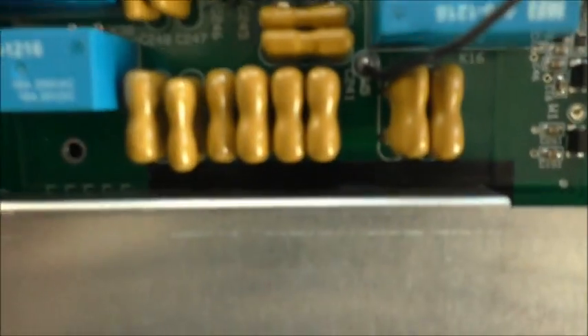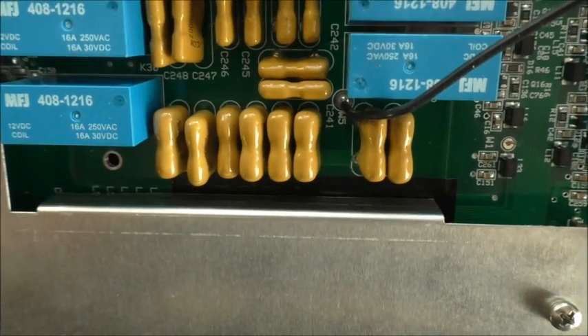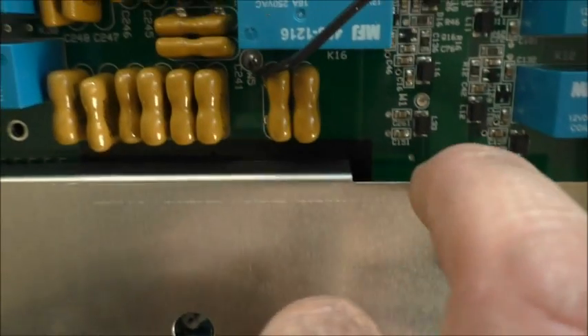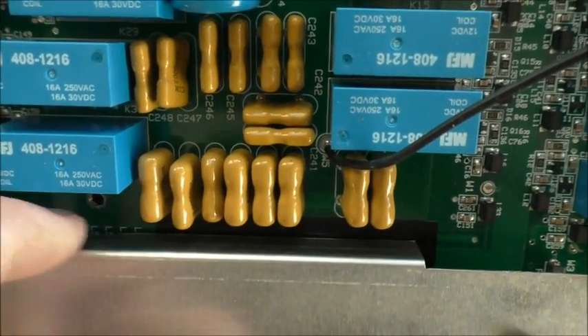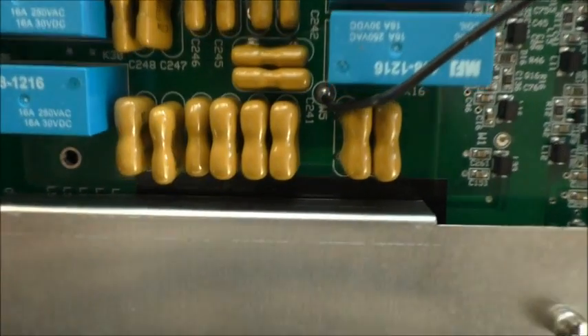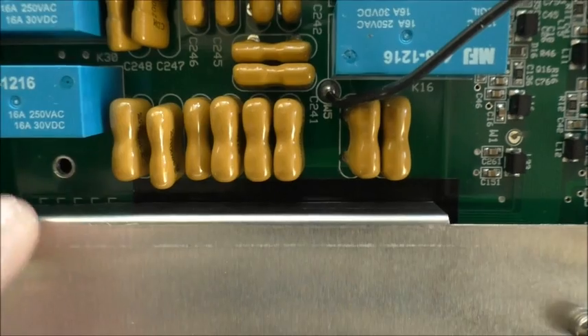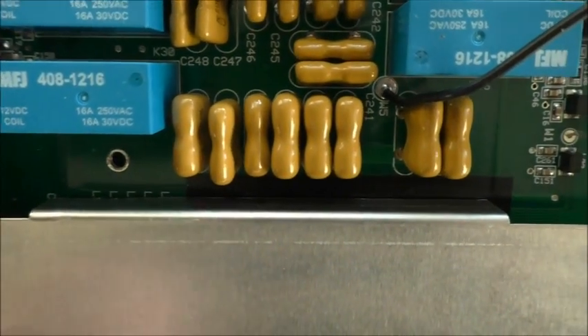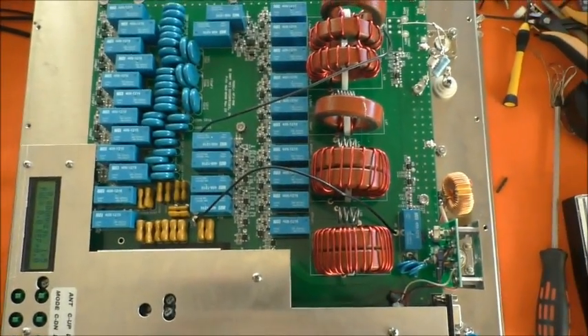And if you've got one of these, it might be worth modifying yours in the same fashion, because that's really not a very good design — having a piece of printed circuit board with the 12 volt rail running all the way along right under this metal flange. It used to go down and then out horizontally, and there's a bolt there holding the thing down. The only thing keeping the 12 volt rail from shorting out onto this is the varnish. So there we go — it's powered up, it's looking good. It's powered through the bias-T, power's going through the RF choke and the new diode fitted under here — it's all looking happy. I think tomorrow I'll find out if it turns.